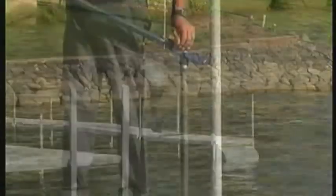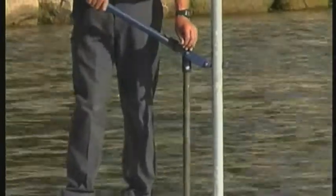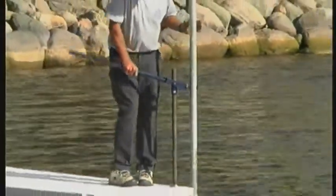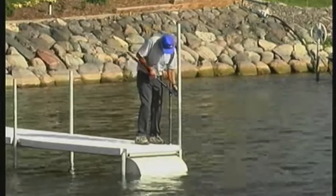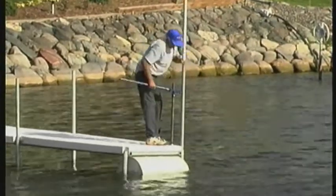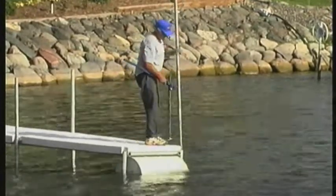After your jack and stand are set up, push down on the handle at least 4 times. If the pipe does not release after 7 attempts, it has most likely been driven into the ground too far. Move the jack across and remove the post on the other side to provide framework support for removal of the difficult post. If this procedure is not followed, you may be using extra time to remove the 2 pipes in this bracket.